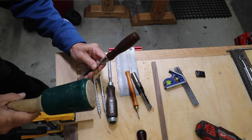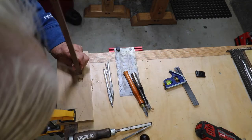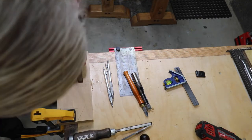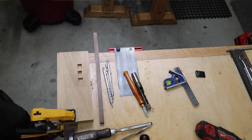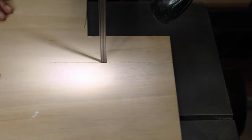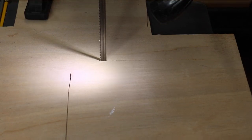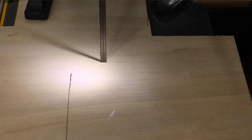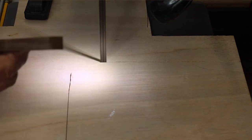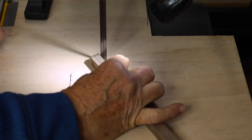Take your pyramid stock and test it with the holes — you want it to be slightly larger than your holes. When moving to the bandsaw, you're going to be cutting out really small pieces and you don't want them to get stuck, so put in a zero clearance plate. That's easy — just slide a piece of plywood in, cut it, and secure it with a clamp. Then hold your stock at an angle and cut off just the corner, trying to leave it short of the middle.